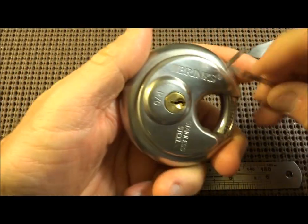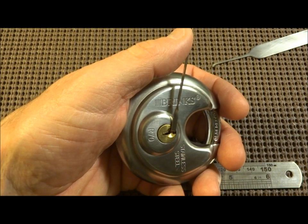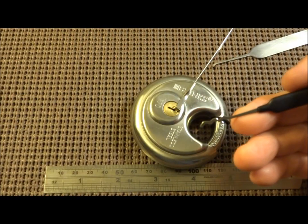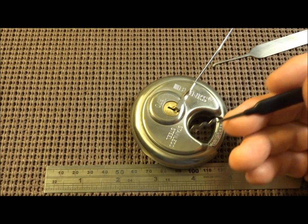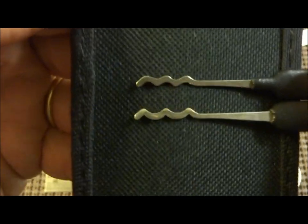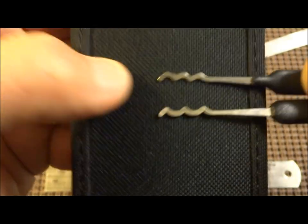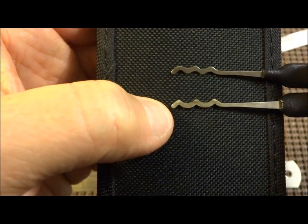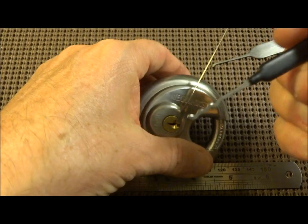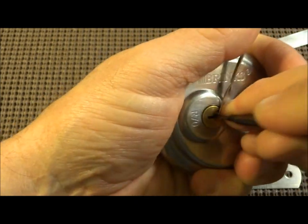Since this hasn't taken very long, let's go ahead and lock this thing up. Because they didn't bother to pay much attention to the bitting, let's just see if I can rake this thing. Because the keyway on this is just a little bit restricted, the rake I'm going to use this time is a little different — it looks like a Bogota, or a copy of the Bogota actually, but a little bit smoothed out. The one on top is the one I'm going to be using, and that comes from a company called Sparrows. It's kind of a unique rake — I kind of like it. It doesn't have as wide a pin-setting capability as the fake Bogota, but in this narrow keyway we can't fit the regular Bogota, so these type of rakes come in handy. Let's see if we can find that sweet spot on the tension and see if I can just get in there and rake this.